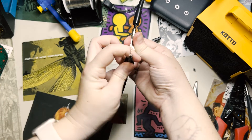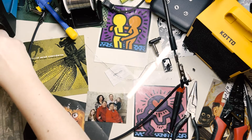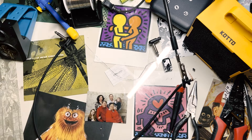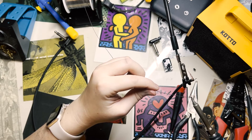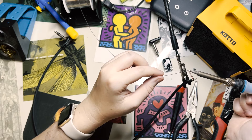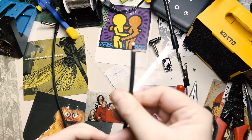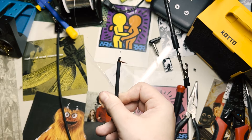Make sure to tin your wires — this makes soldering much easier and also makes for a better connection. I use my helping hand just for this. Turn on the soldering fan and make sure the tip of the iron is clean. Tin the tip of the iron — just put a blob on there. Starting from the top of the wire, touch the iron tip and the solder to opposite ends, working your way down quickly. This should flow the solder. Repeat this for the grounding wire and make sure it's nice and evened out. Note that I did not tin the entire grounding wire, only about the first third, because tinning makes it very rigid and we still need some flexibility.